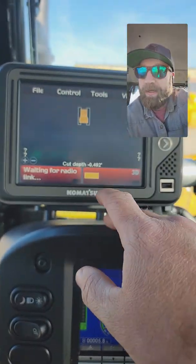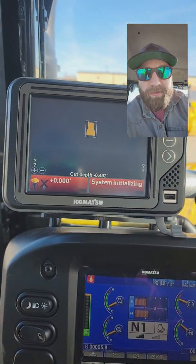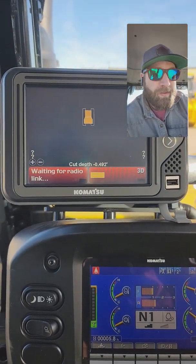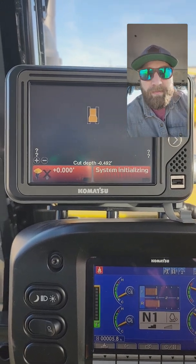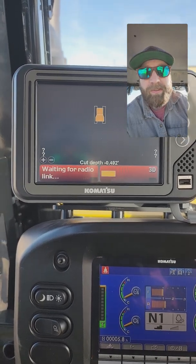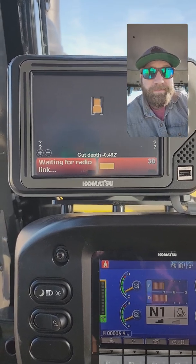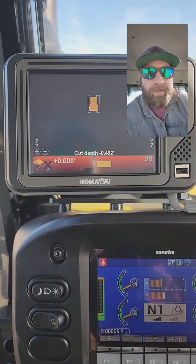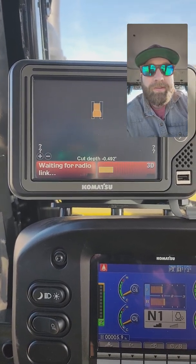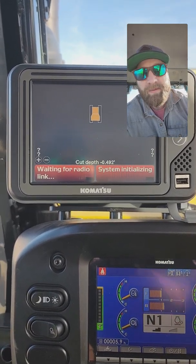It's real simple — IMU cal you can do out in the field. Just be aware that if you don't have a great surface and your grousers penetrate differently on each step, you're going to end up with weird results. This is usually the first thing I check if someone tells me one side's out or the machine's getting out a bit. You can see a little error if calibration is getting out of tolerance. Any questions, send me a message or hop on our website to get my phone number and email.